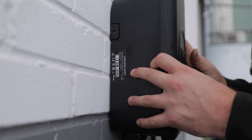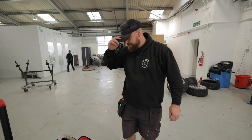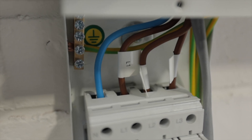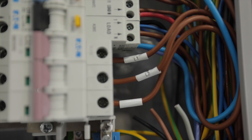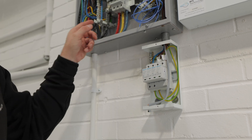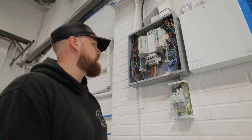This is the surge device — it's all installed. We've got our cables coming down to it, identified L1 through to L3, going up into this three-phase MCB up here, C32. There's a Cat5 that's going to be extended and jointed to the CT clamp for the charger, and that will clamp around the phase we're on within the consumer unit. This is our Type-A RCBO here with the cable going out — for V-Charge they recommend a 40-amp Type-A instead of a 32. So that's all in.